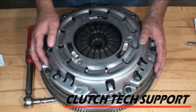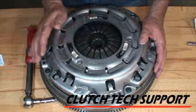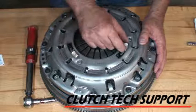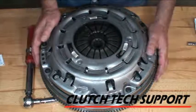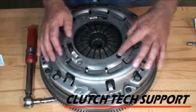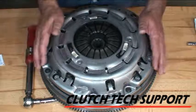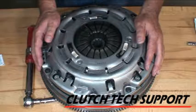A couple of self-adjusting questions come up every so often. Do you need to pre-adjust this system before installing it? No — these are preset and ready to install. Just make sure that the springs are not stretched out when handling a self-adjuster. If a spring is all the way down toward the end of the finger tab, either something has happened to that clutch — it's been damaged or it's a used clutch — don't install it. The springs should be compressed, not quite touching each other. This system will adjust itself as the disc gets thinner from normal wear.